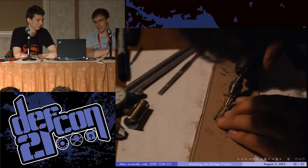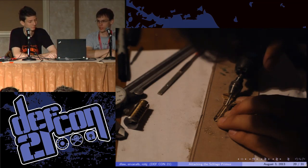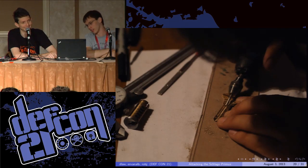You can see the stock Schlage key blank doesn't fit in the Primus keyway because they add a few additional wards to prevent you from breaking the finger pin mechanism. So you thin down the key a little using the Dremel. You can see some of the complicated tools we have in our key duplication lab, such as calipers and a Dremel. It also happens that our key duplication lab doubles as our kitchen table.